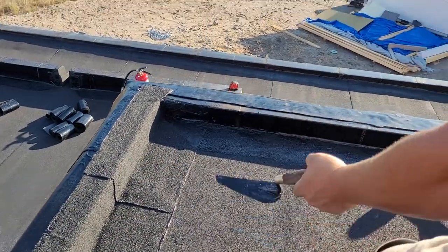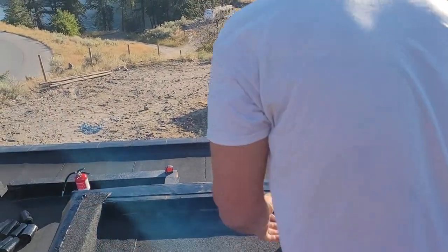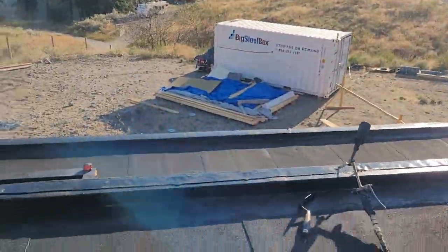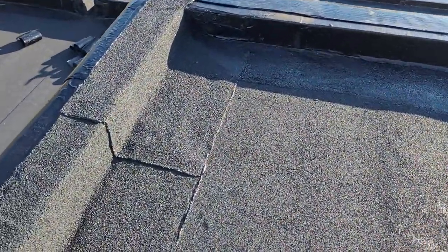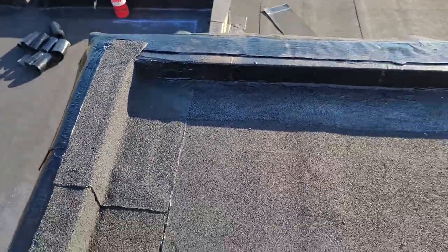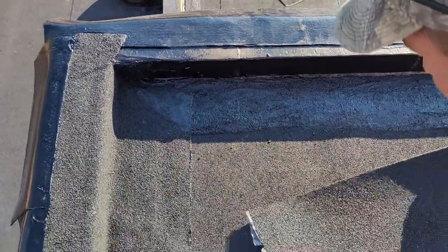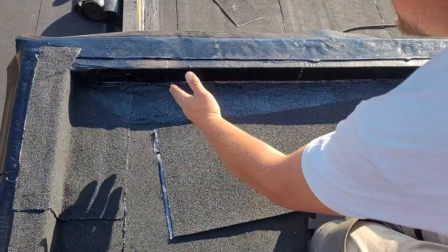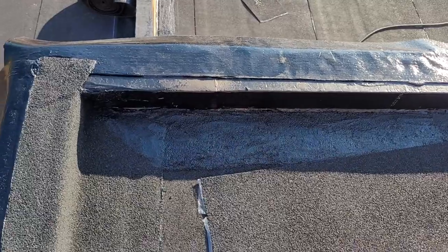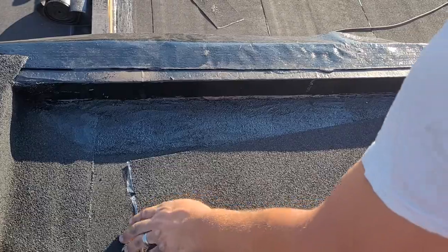Moving right along — I'm gonna grab a piece here and start. It's cooling down right now so I'm taking my time. I am going against my own advice putting a piece on while it's still warm, so we're gonna try not to muck it up. For size: this lap cannot be within eight inches of your cap lap. You need to have a stagger so basically your second ply is covering your laps — that makes everything awesome.